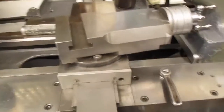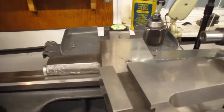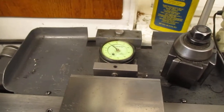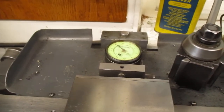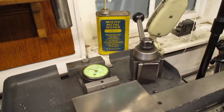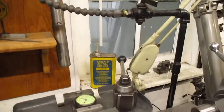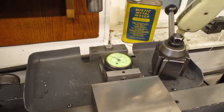You can see that with the digital readout, but I find the digital readout hard to use — I just have to crane my neck. Right across the workpiece I have a dial indicator that reads in tenths, and I use that for the final finishing cuts. You can use the DRO too. But one of the things you'll see is if you adjust the cross-slide and set the indicator to zero, then start the machine, you'll see that jump forward half a tenth — maybe a quarter tenth.